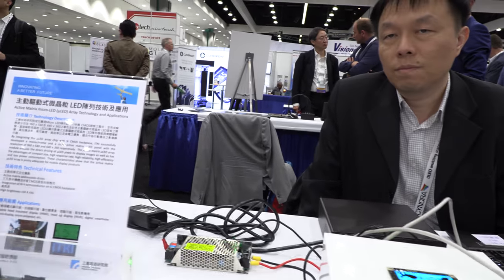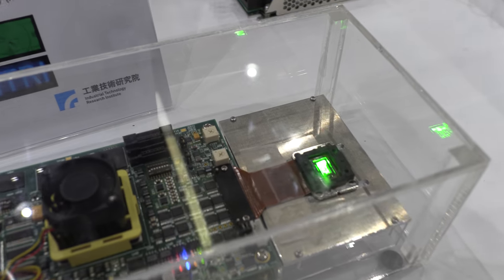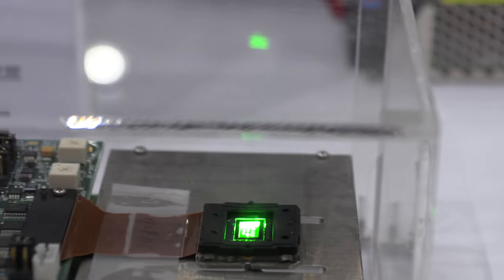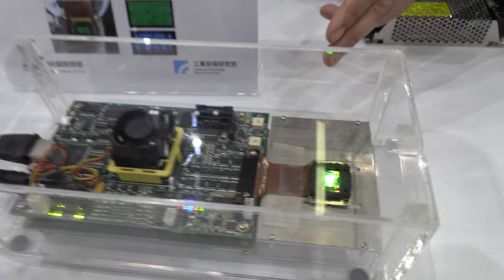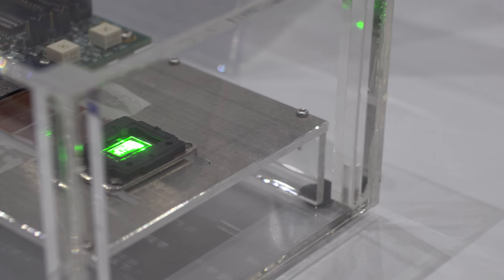And so right here, you're showing another demo — this is a smaller micro LED. This one is a micro display in a single color. We have a single-color gallium nitride chip made in the clean room using standard semiconductor processes. We attach them to the silicon-based driver circuitry, and then use these ribbons to attach it to this programmable FPGA board. So we can actually program what we're going to show in this 0.55 inch micro display.